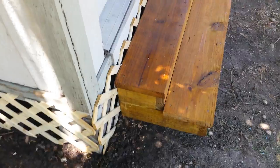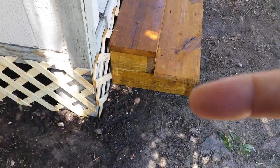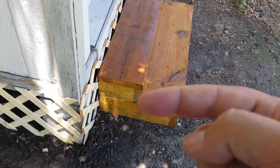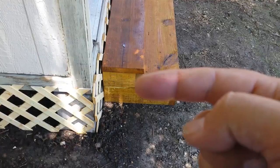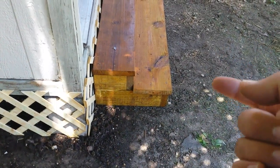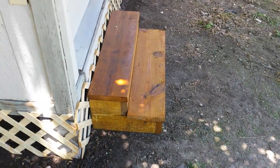Basically just make a frame here out of the 2x6s — one long one here, one there, and then one 3'1" across the fronts of each step. That gives you a little bit of overlap. I cut them at 7.5", which gave you the 9" tread and then a 1.5" overhang over the front for the little lip.